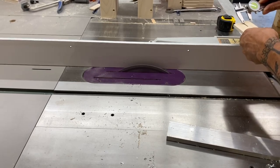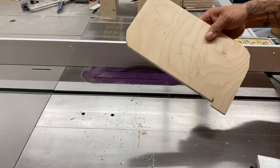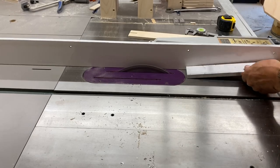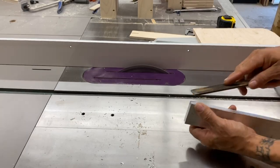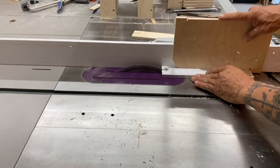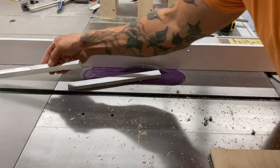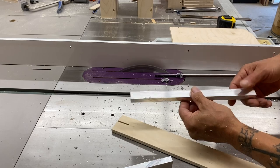I'm using a scrap of plywood just to test the cut width, because the width of these pieces was critical. Always use a push block of whatever type you like — this type holds the material down firmly and the hook at the end pushes it through nice and safe. Must have had a little bit of a burr, so I deburred with a file. I am wearing hearing protection and safety glasses; a face shield would actually be better in this situation.